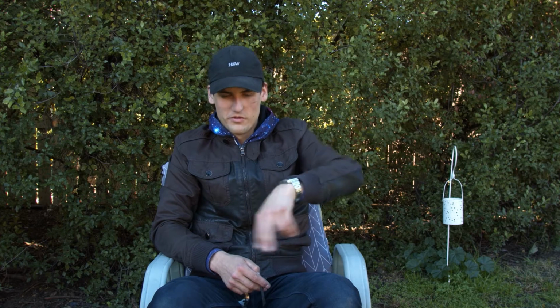Yeah, pretty much. I've had plenty of it cut short. You can tell when it's cooling down because the aluminium turns from a liquid to like a slushy. And if you can't heat it back up immediately, then you've pretty much lost that batch. And what happens if you hold the crucible with the melted aluminium out of the fire for too long? Why don't you hesitate while pouring?